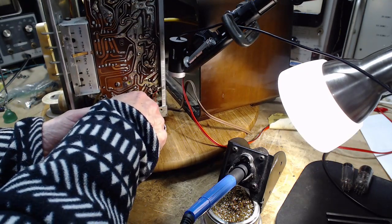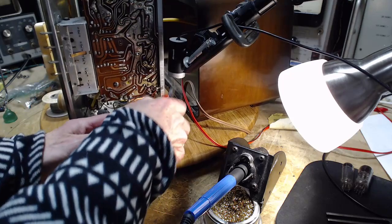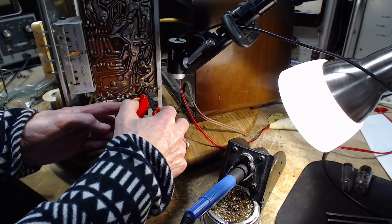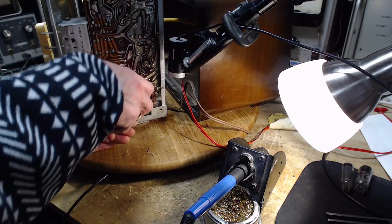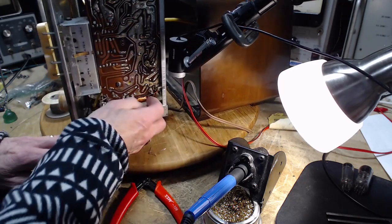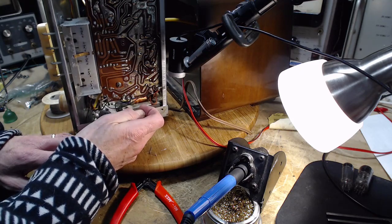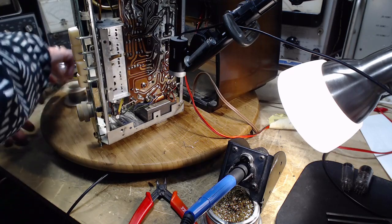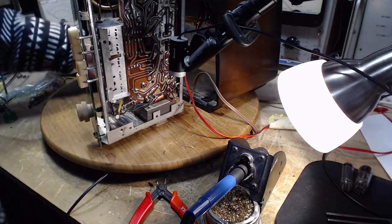So I'm just sitting here thinking more about what I'm doing and realizing, boy, this really can't be the problem, because when I wiggle the output tube, sometimes there's a dramatic pop and loss of operation. But that's really a contact problem in the tube socket, I'm sure. Okay, so I got them on. Got two capacitors in there. Just finished convincing myself that this isn't going to help. Well, no surprise there, but let's just at least make sure the radio is still operating.